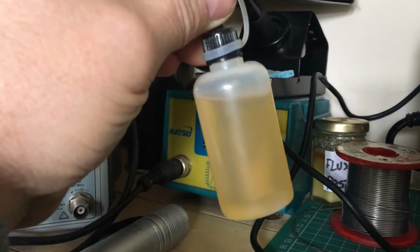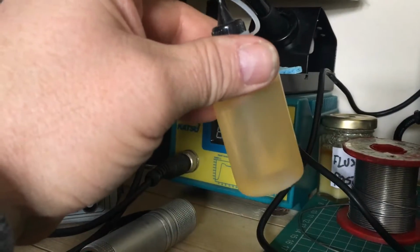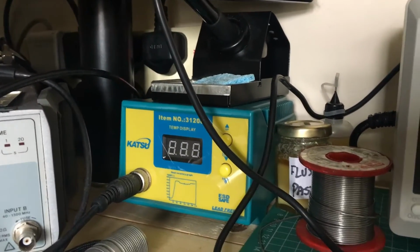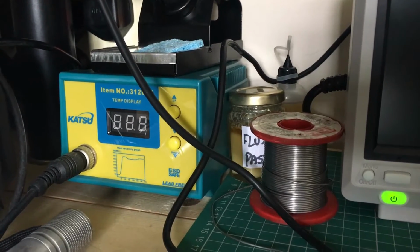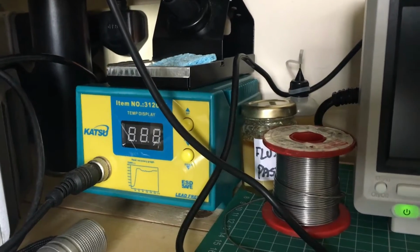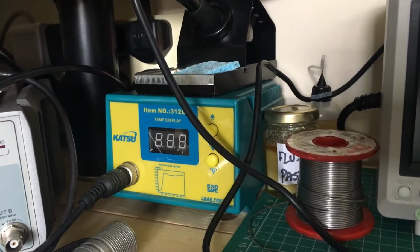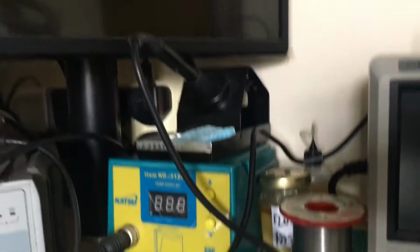This is one of my later attempts, I suppose. The first one I just kept shoving rosin core into the alcohol and filling it up until it degraded, before realising they're better off making a mix of like 60-40. Okay, we've ended up with something a bit more liquidy that actually comes out of the spout rather than the thick stuff that didn't.